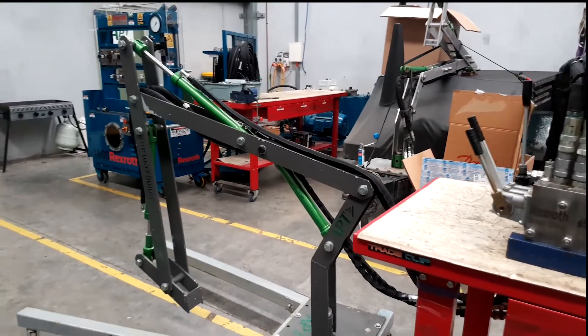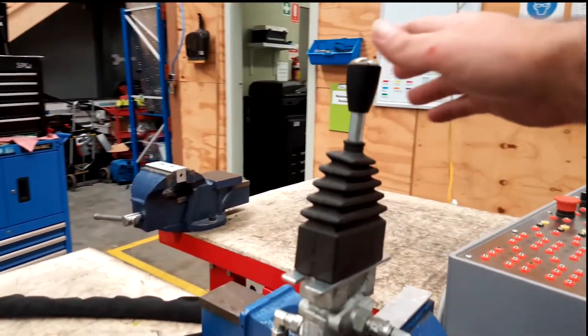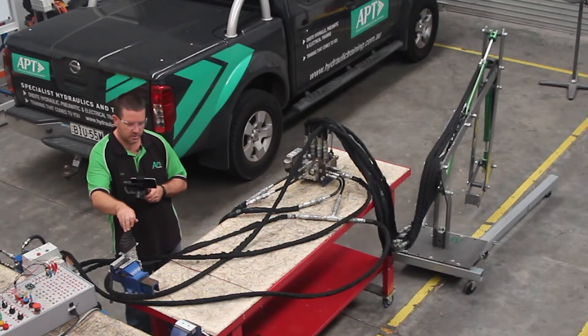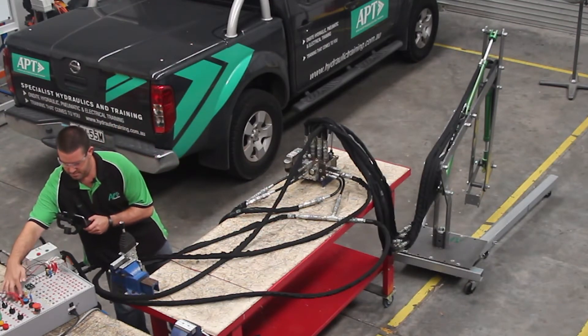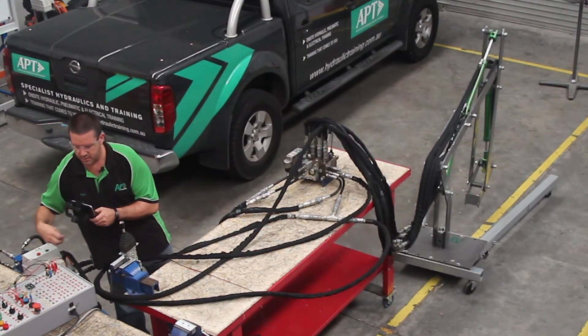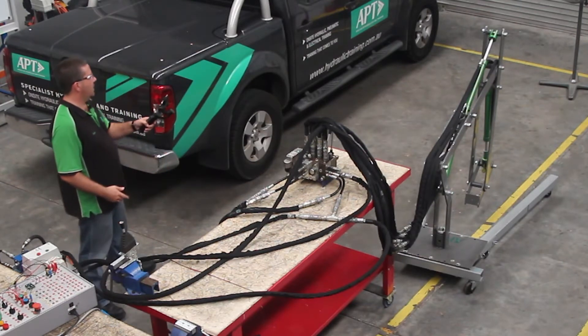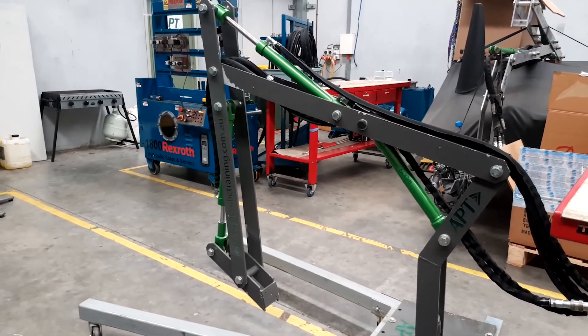That's allowed our boom to come down, and we're quite happy with that. But if I come over and operate my joystick, my stick doesn't move — it's still got energy there. And if I use my push buttons, I might have power — we can see the light over there — but the bucket hasn't moved, so it's still sitting up in the air and I've got some stored energy there.